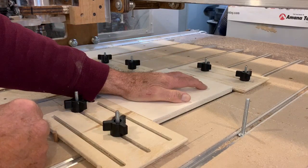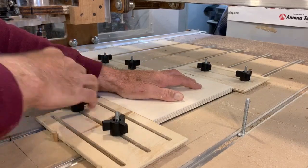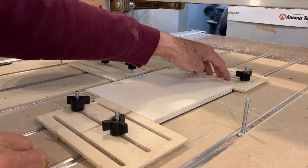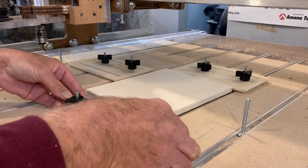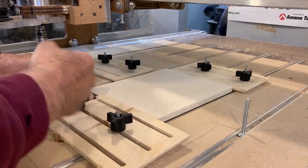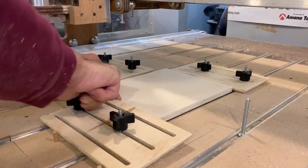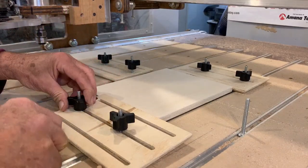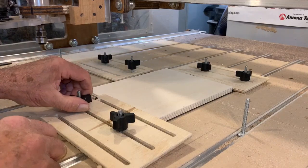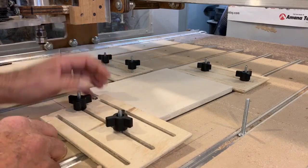Next I'll show you clamping it down. We've got it square, we know it's square. This one's screwed down tight; this one we can loosen and just pop it up and slide it in a little more — now it's in our quarter-inch groove and we just simply tighten it down. Don't tighten it down until it cracks your plywood; just get it down to where the plywood bends slightly and you have enough pressure to hold anything.